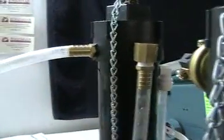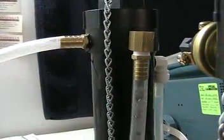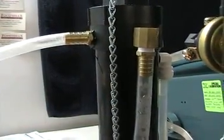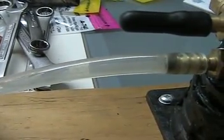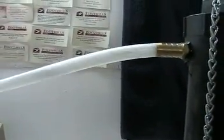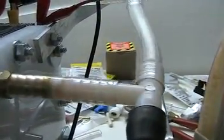Another thing I like about this fluid-gas separator is that since it drops the liquid into an air space, the bubbles can freely fall out of the liquid without having to float up and coalesce and fight gravity. They're dropped onto the surface so that the impact shakes them out. And when you look at the bottom, what you get is very clear liquid — so it doesn't recirculate the foam, which is a nice feature. We're still going back and forth on designs for fluid-gas separators, but we'll get it figured out. It's just part of the R&D.